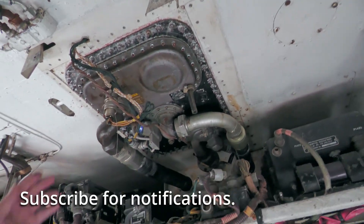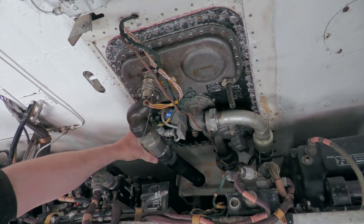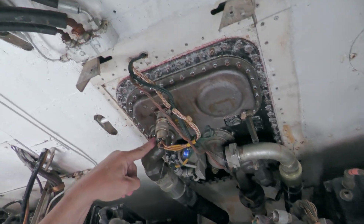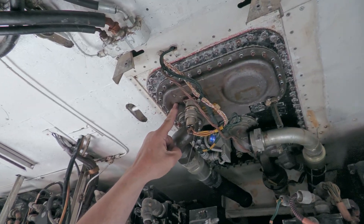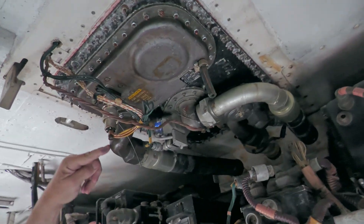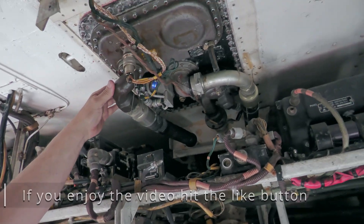Basically what we're looking at, we're just going to have a look at the joints, see if we get any fuel off them, which doesn't look like there is. These are the pipes going out from here — this is the outbound pipe from the fuel pump. This is a fuel pump plate; the pump sits on that plate above there. The fuel is directed out of the fuel pump, down the back, into the gallery for the engine.